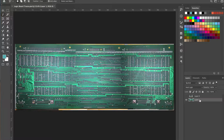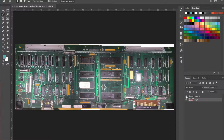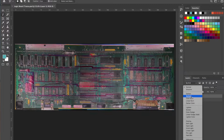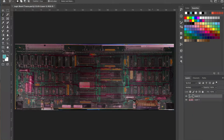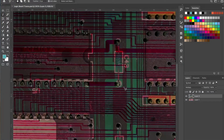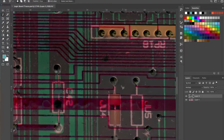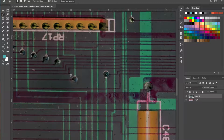The first thing I thought of was to superimpose the underside of the PCB with the top of the PCB. That way, I could see the traces on both sides and see where they go. I had to take the backside and flip it horizontally so that it would be the right way around when I looked through the top of the PCB. I inverted the colors of the underside and then overlaid it on top of the PCB. Top is green, bottom is pink. You can see where the traces enter via from the top and then continue along on the bottom in pink.